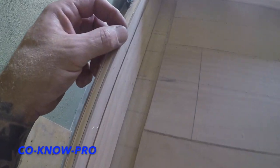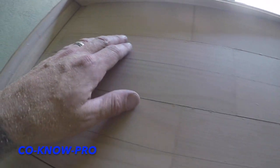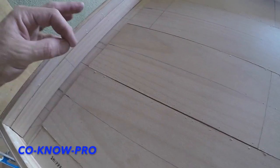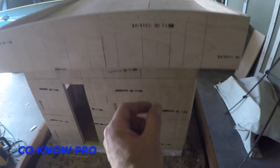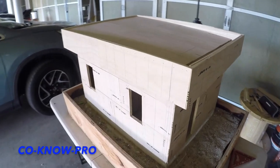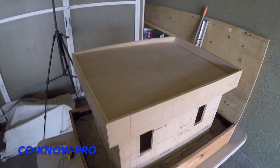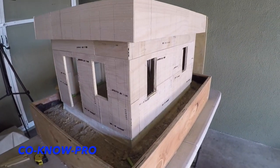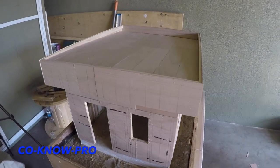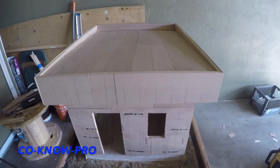There it is everybody, we got it all done. We got the whole house sheeted, we got our roof drainage done, we got our roof sheeted, and we got our cricket installed right there — that's all for our water runoff. So we got a 2% slope, water will go down there, it'll go into two drains right there, and then it'll go down the drain pipes and into your underground water system so it can drain away from the property. Tiny house, we're getting this thing built. We're going to be doing some different kind of veneers, a stucco finish on the outside, some tile work, some drywall work, and we even got some insulation. So stay tuned for more videos, and remember subscribe and like everybody. Conan Pro out.